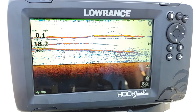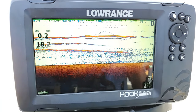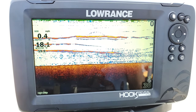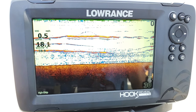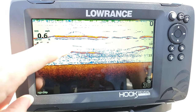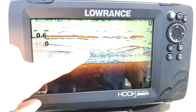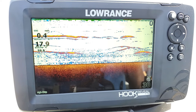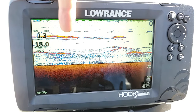Whenever you're moving around, you're actually going to get the arches on the screen, which is what you're used to seeing. What creates those is as you're driving down the lake, as the fish enters into your sonar beam, it starts creating the arch as it goes up into the center of the beam and then goes down as it's exiting. Once it leaves the beam, you get a nice little arch on the screen. Since I'm sitting still, I'm going to get straight lines, but generally fish aren't always still — they're usually swimming around, so you'll see the lines move up and down.